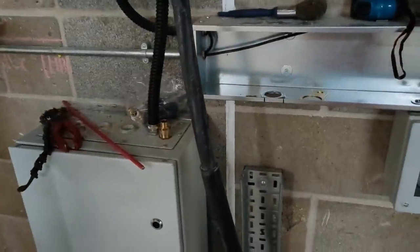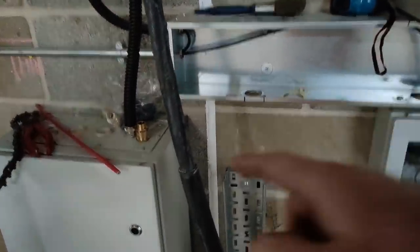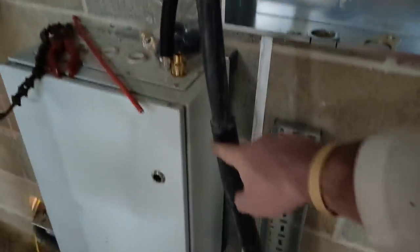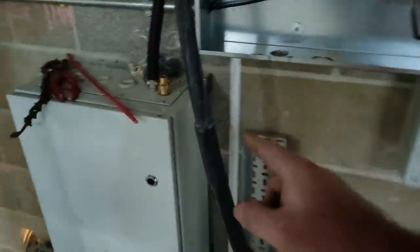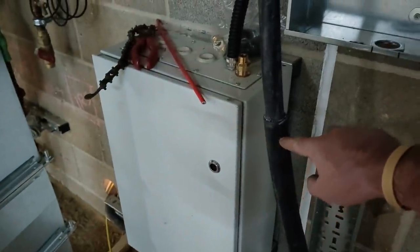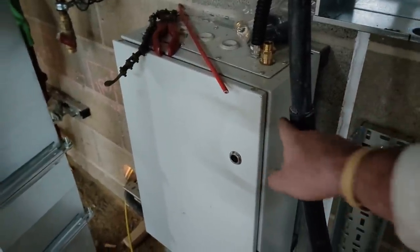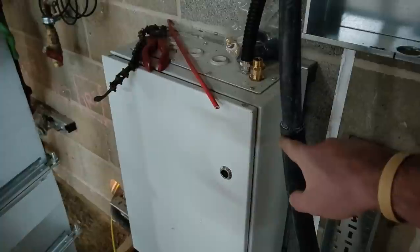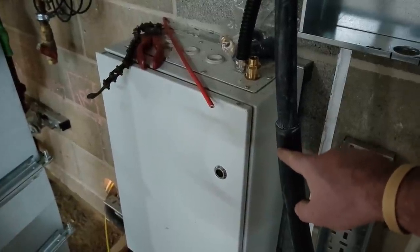So we'll try and have a look at that. I do it again with the exhaust cutter, just don't put as much pressure on. You can obviously do it with a Stanley knife, it's not a big deal, but I like to do it with the exhaust cutter because it gives you a nice round, even line, and it meets up, obviously. Whereas when you go around with a knife, you could be high or low, and it just looks that little bit better.